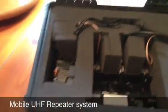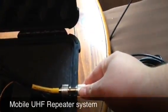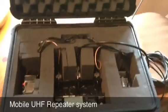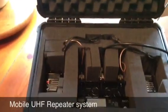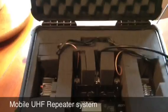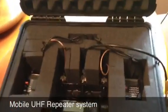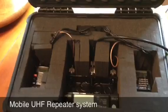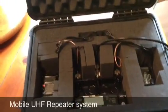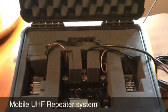What we're going to do pretty soon is drill a hole with a connector and put a mobile antenna on the side of it. There are a lot of possibilities — you could even not use a duplexer and just keep the antennas on here. I've known some people who put extension cables and actually mount the HT handheld antennas on the outside of the case. Not sure about the interference you'd get with those two antennas being so close together, but it is a possible thing to do.